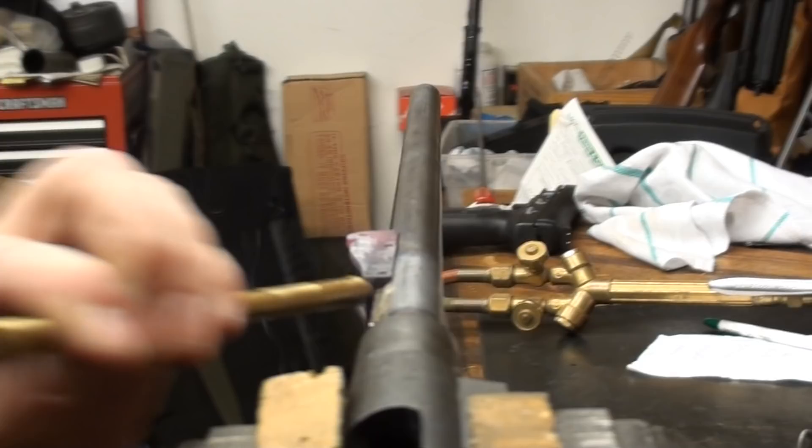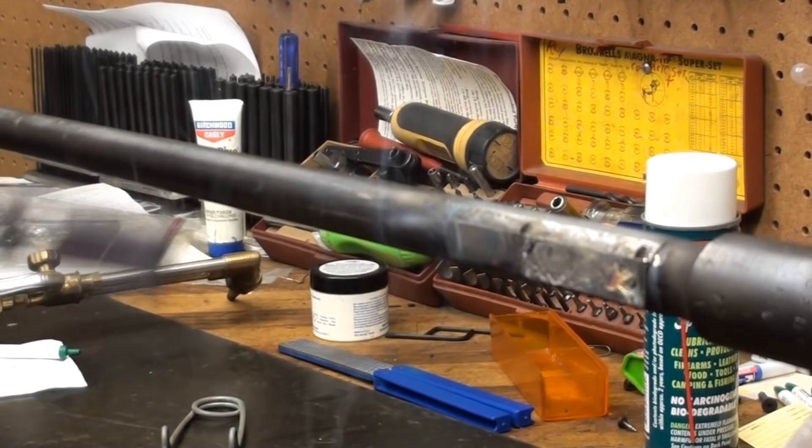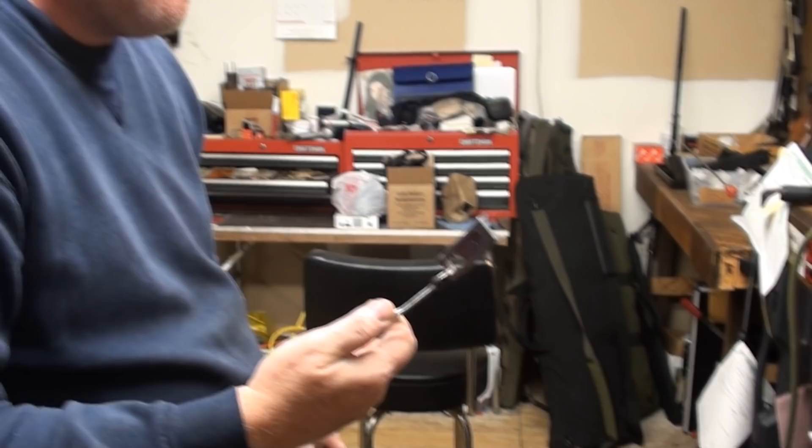There she goes — there's our sight base. So we had to get that up to probably about 1,200 to 1,300 degrees — pretty darn hot. It takes about that to get it starting to glow. I believe you get a good dark cherry at about 1,100, so it's probably 1,200 or better.